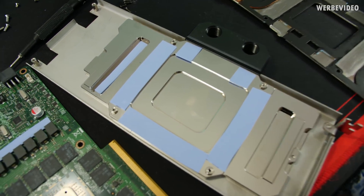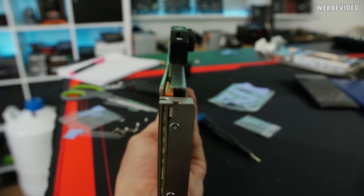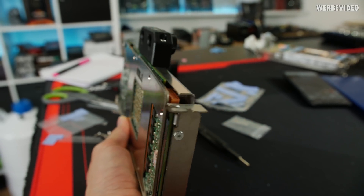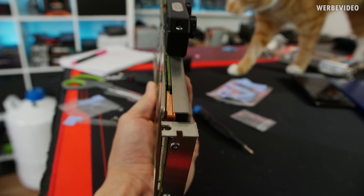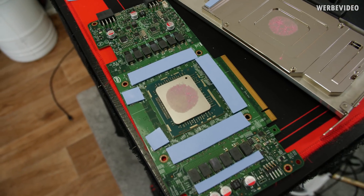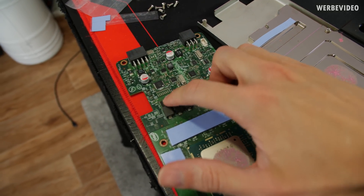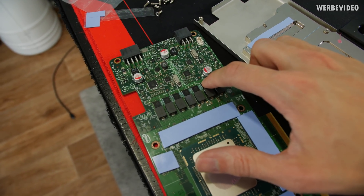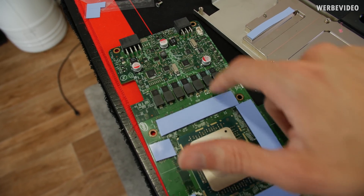We'll have to investigate that. We're using the original backplate but you can see it's bending slightly - this part of the backplate which is supposed to make contact with the cooling block seems to be a little bit too thick, so we'll have to grind off a little bit of that. Without thermal pads on the inductors it looks much better - pretty much perfect contact. The pads on the inductors are not that important anyway; you remove most heat over the power stages which are much more temperature-critical. We have enough contact over the memory chips and power stages, so this should be okay.